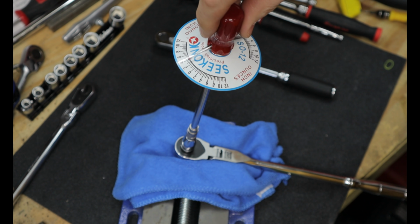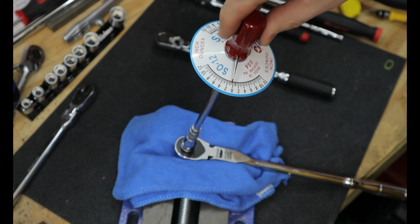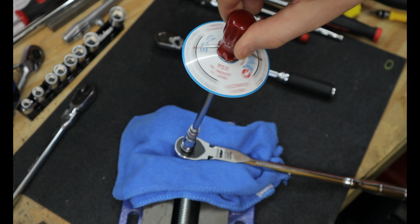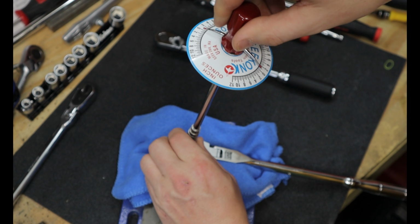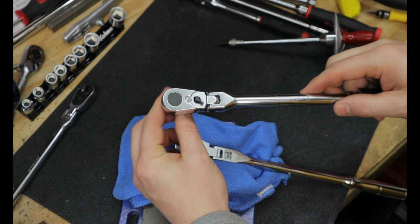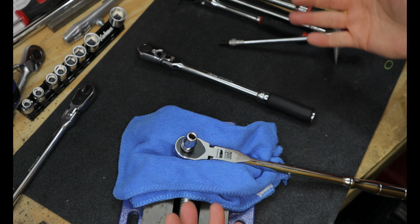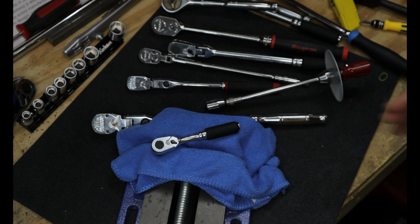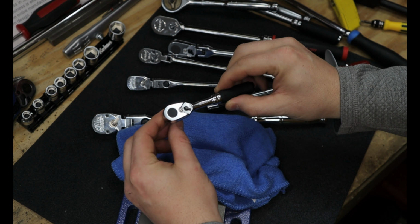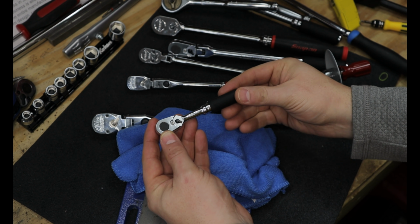Now this again will get better with time and how you wear in that ratchet, but I didn't have to have any break-in or any wear. And the Koken ratchets, you know, these here were producing 2 ounces, which was far superior than all of the tool truck brands. Now you can see when it comes to backlash or backdrag, the Koken Series Z ratchets are just far superior.